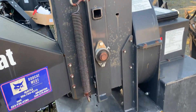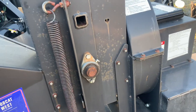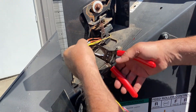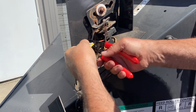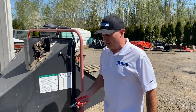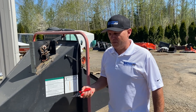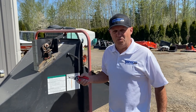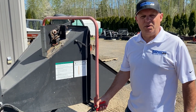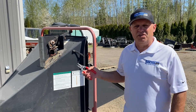You can see these springs — there's one on both sides and this whole mechanism slides up and down. The first thing we're going to do is get rid of all of this — the rack system and CAN controller. We just cut it as close to the crimps as possible and this literally goes in the garbage. What happened was the control module no longer worked, so they took it to auction and the customer picked it up really cheap. That's about a $1,200 computer that isn't necessary — we get rid of it and turn it into electrical-mechanical operation, and this thing will last forever.